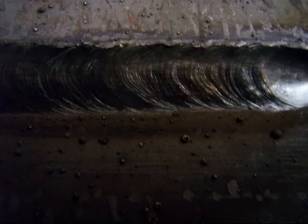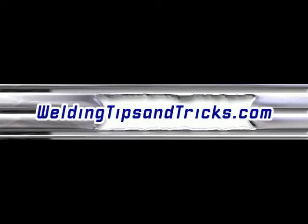Here's another 7024 weld, a little hotter on a lap joint. Don't weld with 7024 overhead, please. You'll wind up with a pant load full of fireballs.